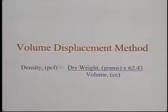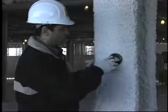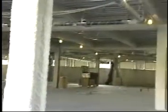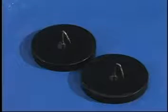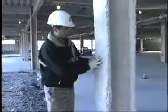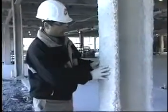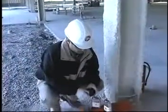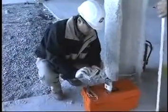When performing bond strength testing, conduct one test for beams and one test for decks for each 10,000 square feet of floor area with a minimum of 2 tests per floor. Hooks should be inserted into the caps prior to arrival at the job site. Prior to testing, the SFRM must be fully cured and dry. Normally, SFRM is dry and fully cured 21 to 28 days after application, depending upon thickness, temperature, humidity, and ventilation.